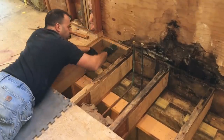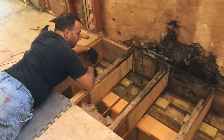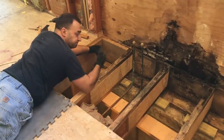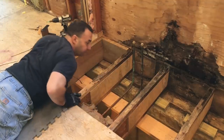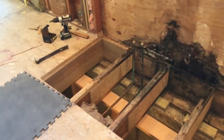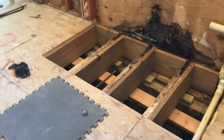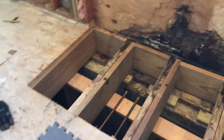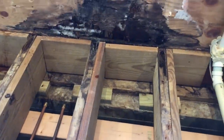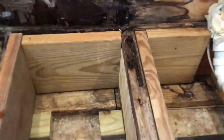I hope this will be secure because now the floor will sit not only on top of all of this but on top of this as well. I'll finish up the other two or three bays. Well, this is where we're at — all the bad joists are reinforced and I'm ready to get some plywood on here. That's called sistering up the joists, and I did the three that were severely rotted.